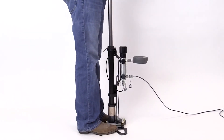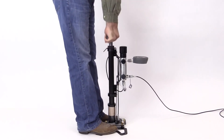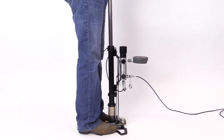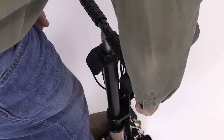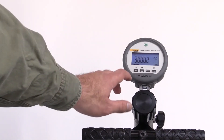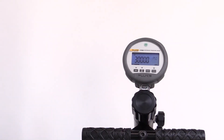Pump the 700 HPPK to generate pressure. Generally, you can generate 21 MPa within 20 seconds if you pump with full strokes. When the applied pressure gets close to the highest targeted pressure, close the inlet valve. This helps to stabilize the pressure. Use the variable volume control to adjust the pressure and achieve the exact target pressure on the reference gauge. Take readings from the reference gauge and the test gauge.